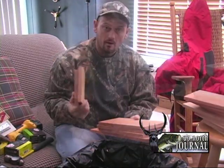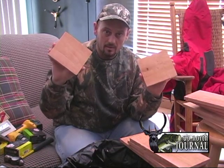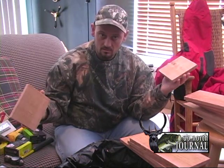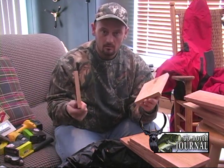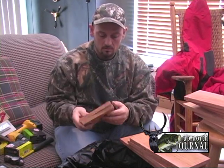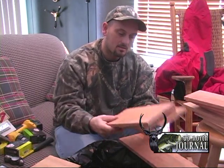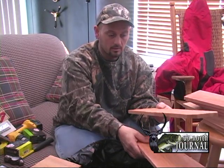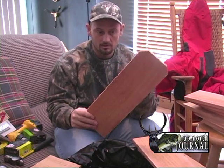So let's get started. After you cut your wood, you're going to have the front and the back of the box. We're not cutting anything to width. When you buy this long piece of wood, this dog-eared fence slat, it's actually 6 inches wide, and we use that as the complete width of the box. These 2 pieces here are 6 inches long. The sides and the bottom of the box are 12 inches. You wind up with 3 of these, and the actual lid of the box is 17 inches long. It's a little longer, and that's what you can actually lift open the top with.